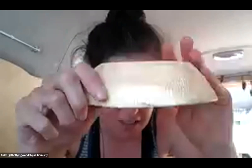So some of it is like open pore. Okay. Really strange wood to carve. Yeah. So it was still really rough, and then I remembered I bought this mini scorp recently, so I used that to texture it. Yeah, nice. And it was also a good, lazy way to mask the rough outside, because it's not even at all, but with all the tiny marks. Yep. It looks better.